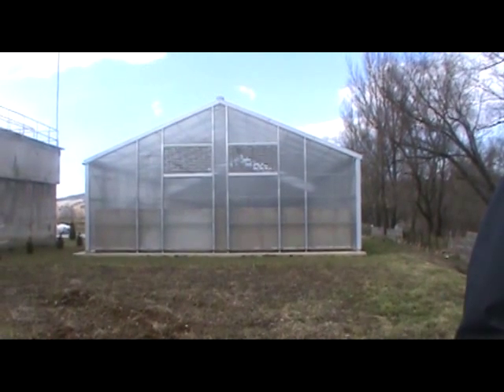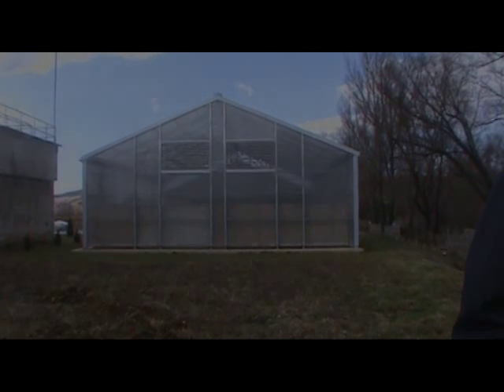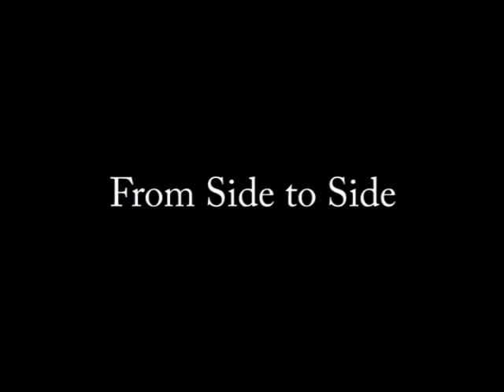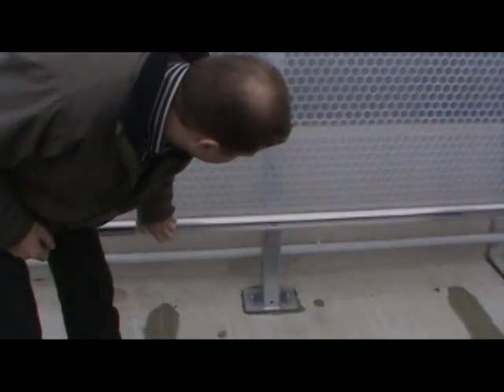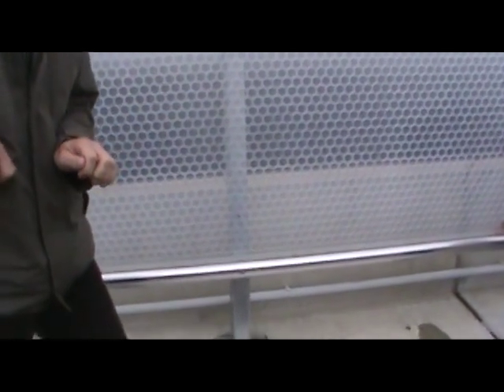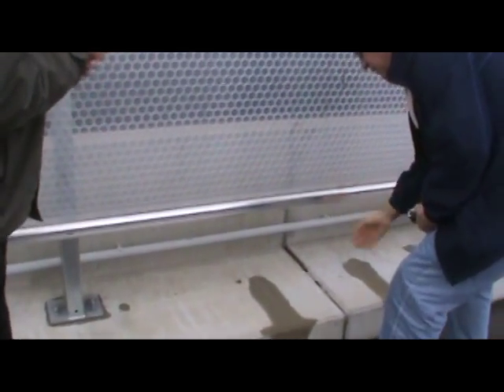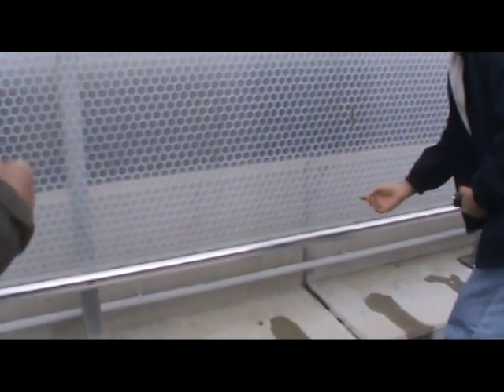Greenhouses can be ventilated in one of two ways: either front to back, as in this example — this is the back — or from side to side, as this example shows. The dry air enters from the bottom on the side, blows across the sludge, and after it has picked up its moisture, it exits through the louver.